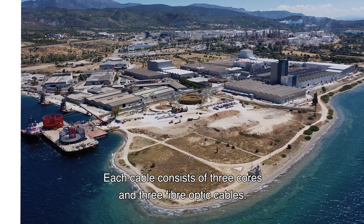You see behind me the winch that pulls with a maximum of 40 tonnes the cable through the HDD duct. Once they have pulled the cable through, they seal the ends of the HDD duct — the pipe — on both sides, both on the vessel side and on the land station side, and they fill it with water to cool the cable.